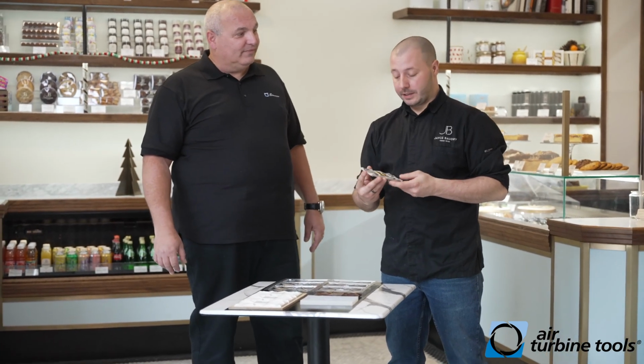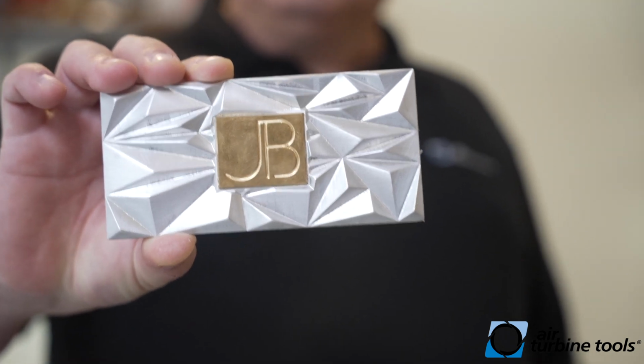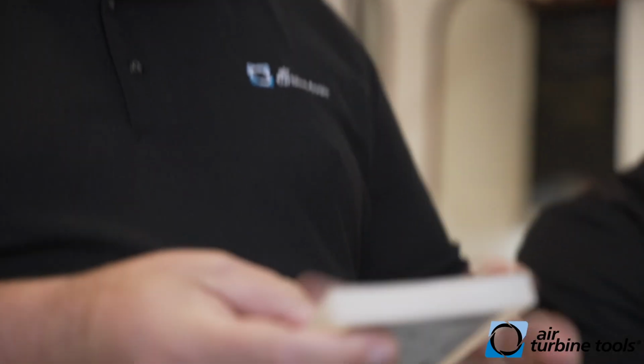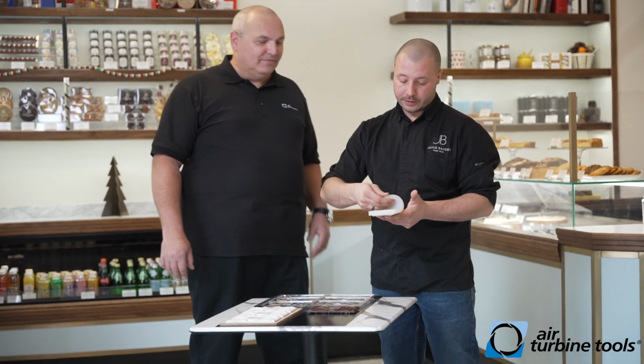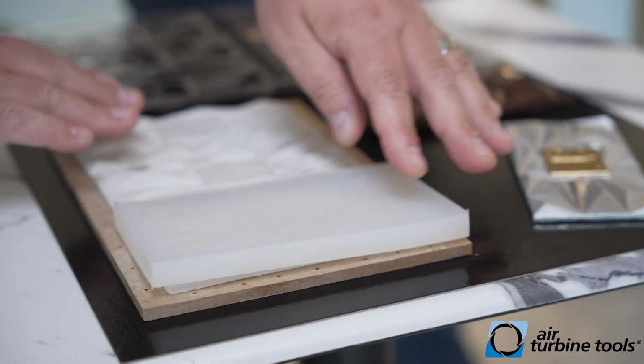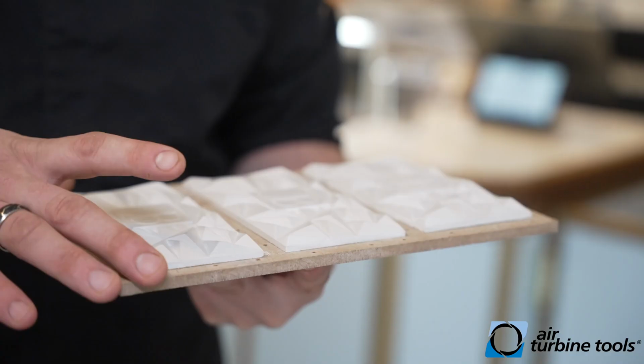So Olivier and his friends and teams have designed for me this matrix, personalized for a chocolate tablet. From there, I create a little box all around this metal matrix, and I pour over silicone. I let it go overnight, and the next day I was able to remove it and create a mold of this matrix, to create another matrix which was going to be made of plaster.